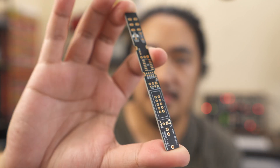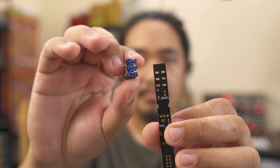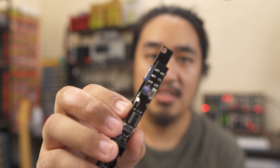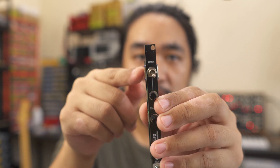For this build I tried their matte black solder mask with gold immersion plating — I really like how this combo looks. As soon as I started building, I found some mistakes in my design. First, I used the wrong footprint for the toggle switches — I was supposed to use single pole switches but instead used the footprint for double pole. Good thing I had some double poles in stock so I was still able to build it, though it sits a bit wider than the actual module itself.